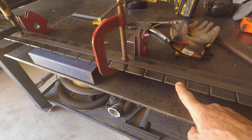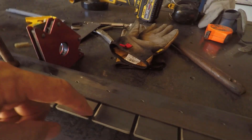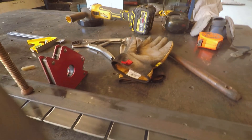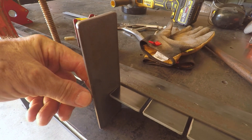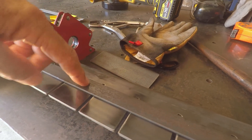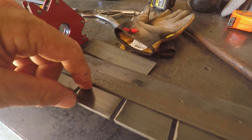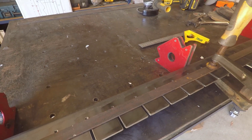Now that I've straightened the three slat frames, I need that 25 mil depth. This is the slat — it sticks 25 mil into the slot and protrudes 25 mil above the slat frame. I've measured off the back — this is a piece of 20 mil flat bar, so from the back edge to the top edge is 50 mil, giving me 25 there. I've dialed my combination square to 30 mil on the back edge and lined up the flat bar all the way along. Now it's just a case of spot welding this in place. I'll do all three and show you when I've finished.